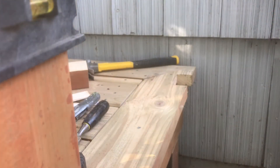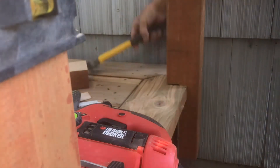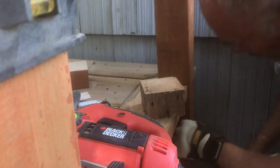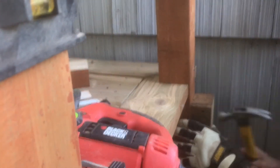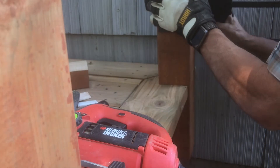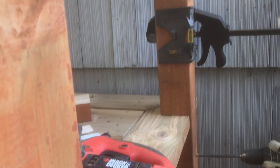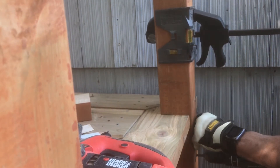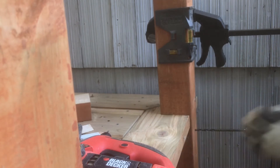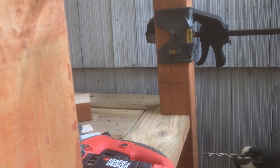I'll get my post for this and get it wiggled in there. Grab my block of wood again and my hammer and tap it in there, then grab the post level and clamp it on so I can see both directions that it's square. This one's pretty square — I'm not even going to have to shim it. The board must have been twisted a little bit on the fascia on the other one, pushing the post in. Just a little twist in the wood.